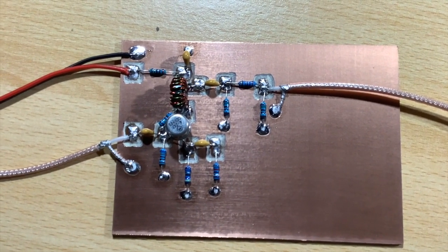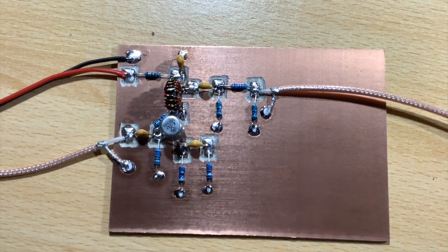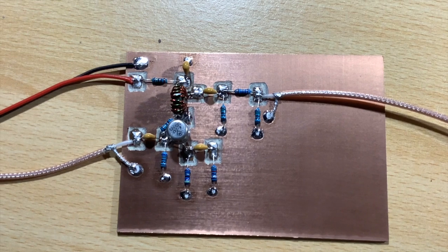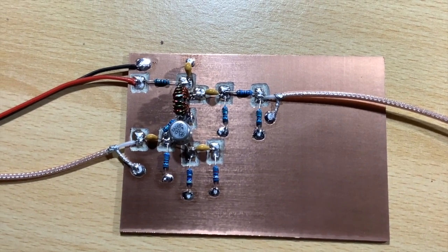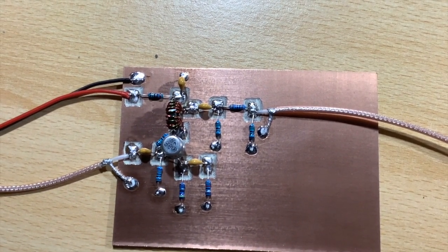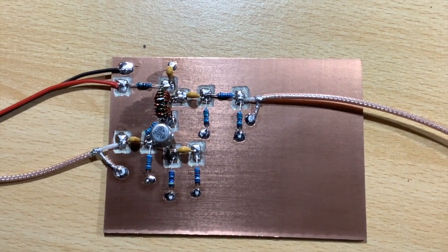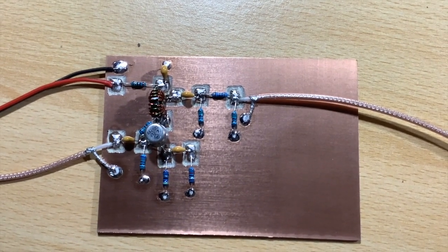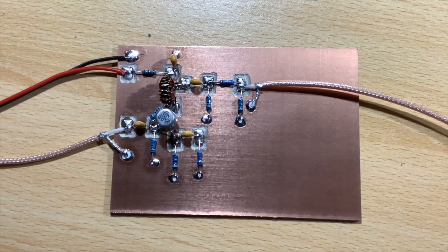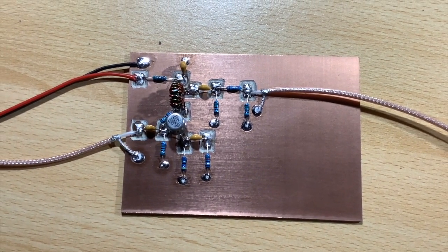After I soldered it all up, I went through and checked with the multimeter, and I'm glad I did, I tell you, because I found one mistake. That resistor, which is going diagonally on the top left-hand side of the transistor there, was not soldered in right and was skewing all the resistances. That's what you have to watch out for. So I'm pleased I did that, because it's worth spending a bit more time now while the soldering iron is hot and I'm at the bench, rather than when I'm in the house later testing it on the scope. So it was worth doing that.